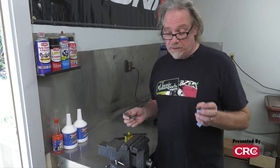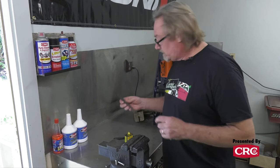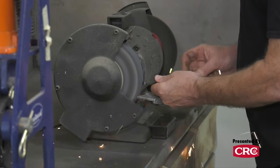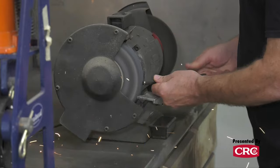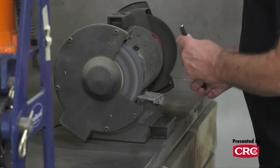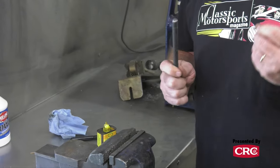Let's get into something a little tougher — let's actually cut some threads on this 7/16-inch rod. The first thing we're going to do is bevel the end down again to make a nice easy start for our die. We've got the edge nice and beveled — you don't need to do very much, a sixteenth of an inch is fine. You just want to give the die a nice easy start.